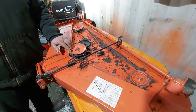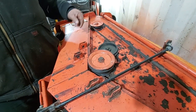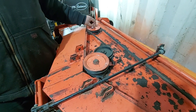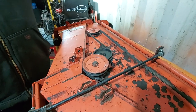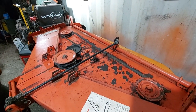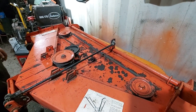On these newer series, the pulleys are all welded right to the spindles and come out from the top pretty quick and easy. On the older series, the pulleys are keyed on and the spindles drop from the bottom — the pulleys can be a bear to take off sometimes. I will do a video on those because it's quite different, but the principles are similar.